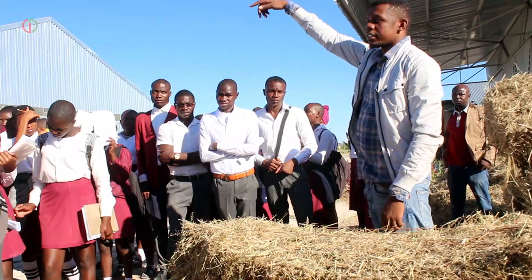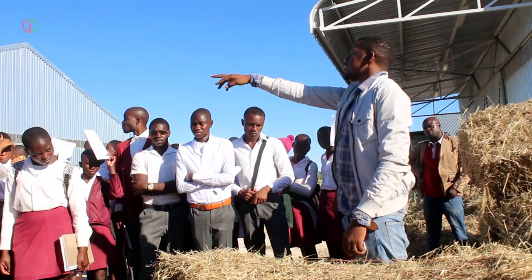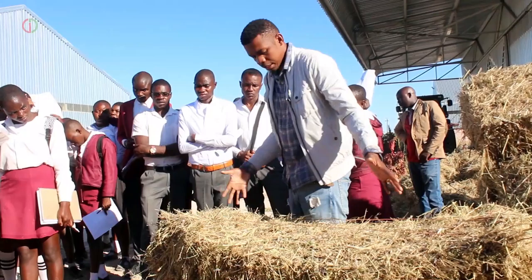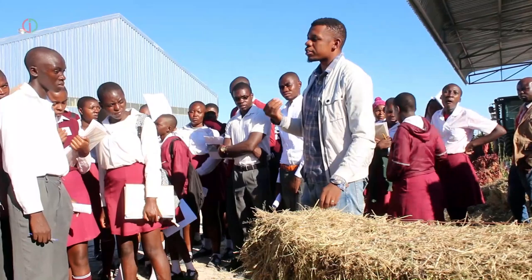Who is finished with work? The slasher. So when he's finished, if the others are behind, because maybe they were baling this side, the other can go home if they are done, if there's no other work. We have assigned them for that. The baling machine is also packed now because there's no time. So you understand? These are the three processes. You cut first, then you rake it together, and then the baling machine gathers and compacts. This compaction happens in the baling machine. When you harvest it first, the moisture can range from 58 to 40, and as the grass is drying, because if it's staying in the sun, what's happening to the grass?